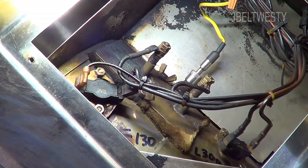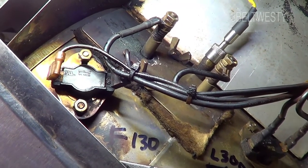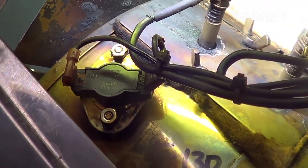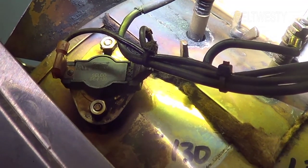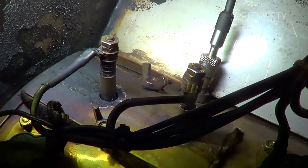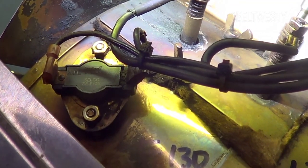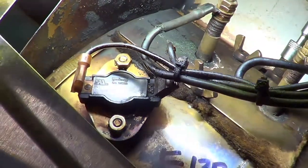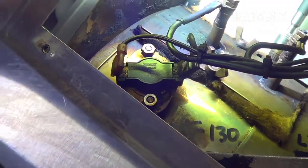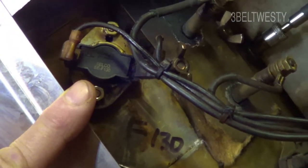The one toward the top is called ITS — that's an F130, the inverse thermostat to control the blower. When it's above 130 degrees it kicks on and turns the blower on. So after the heater has been commanded off, the blower stays on until the incinerator cools down. That F130 right there is the inverse thermostat — it keeps the blower going until the temperature comes down to 130 degrees.